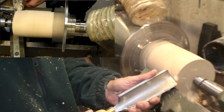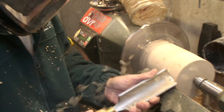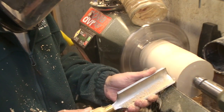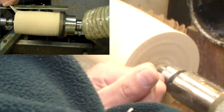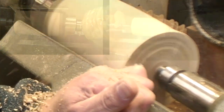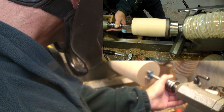We're turning it down to approximate rough maximum diameter — four and a quarter inches. This is the size I also need for my other woodworking chuck. This way I have a part that's ready to drill. And while I'm at it, I'll square off the end so that we have a nice square round block to work with.